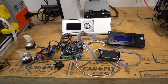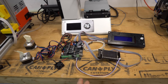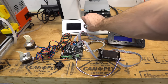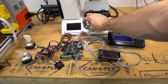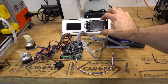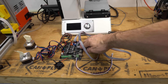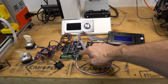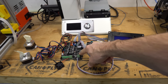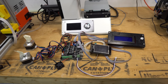What did I do during this weekend? I was planning to replace the board and the screen on the Monoprice Mini because the screen is not that useful. That button is flaky and hard to get working right, and when it's printing it's out of reach. So that's why I wanted to replace it with a color touchscreen. In doing so I'm also changing the motherboard inside the Mini for a MKS Gen L with Marlin on it, which permits me to have features like linear advance and more safety features for the whole printer.